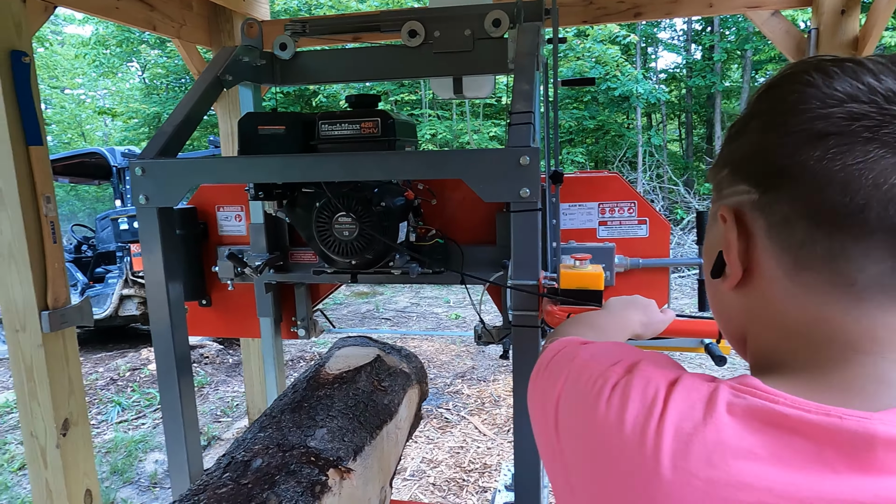So I took this plate off. I drilled the roll pin out of this handle to take the handle off, and I actually ordered some new roll pins so I could put it back. But right now I got a cotter pin in there, so it's a little loose. You take this off, and there's two jam nuts behind here. You can take those loose, and you can actually take this assembly apart, and there's a bearing inside there, and that bearing was probably just sprayed with some liquid lubricant or something because it was pretty well dry. So I packed it with grease, but I don't think that's where the squeak was coming from because I got it all put back together and it still squeaked.